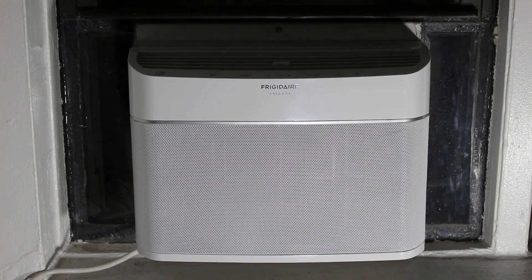Inside, we have something known as the indoor coil, which is actually our evaporator coil, and it provides cooling for the indoor space. On the opposite end, that is our condenser coil, and it rejects heat — it's hot, it's blowing hot air out.